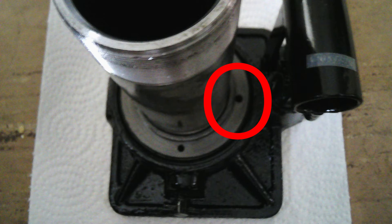Now that we're inside the hydraulic bottle jack, the first part is to prepare both the brake line and the inside of the jack for the join that's going to take place. You need to very carefully clean off any residual hydraulic fluid from around the intake hole — that will be a circle — and also the wall behind it, so that no hydraulic fluid gets mixed with the JB Weld as you do the joins. Start with a paper towel and then clean it up afterwards with a rubbing alcohol pad.